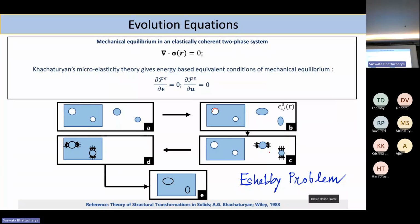Okay, if I take a volume, this is called a control volume. Say I have taken this control volume. You have to understand there are two types of forces. One force is like the force of gravity, and that acts at the center of mass of the body. That's called a body force. And then there is another force that comes due to surfaces, right?